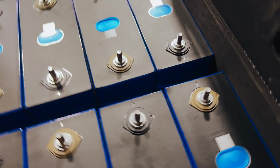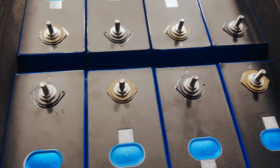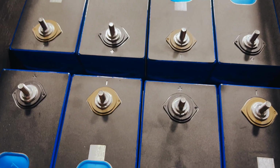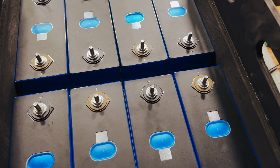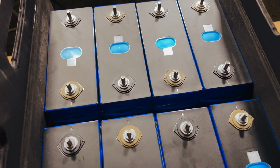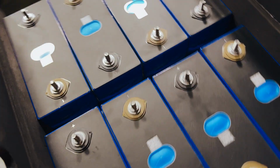This is going into the engine compartment of a boat, and in case there's a bit of vibration, that'll stop the aluminium of the cells contacting. I haven't put on the outside because the wood is fairly non-conductive, so we don't expect a problem. In any case, if they are actually rubbing so that stuff comes off, then there's too much vibration, there's a problem anyway. So the yellow thing here is just to stop sort of fireworks. So that should do the trick.